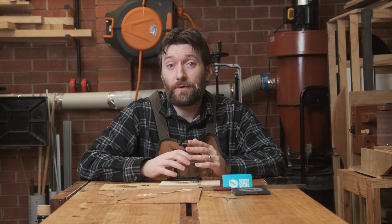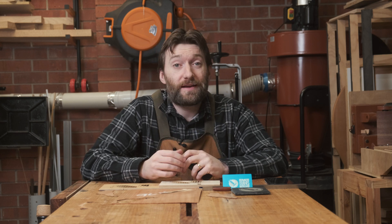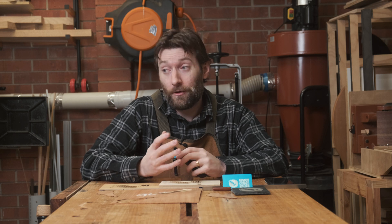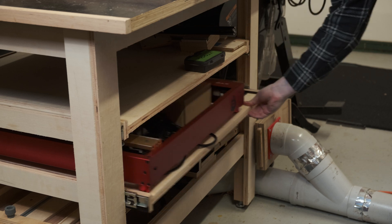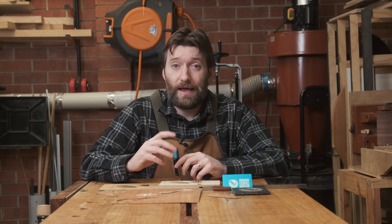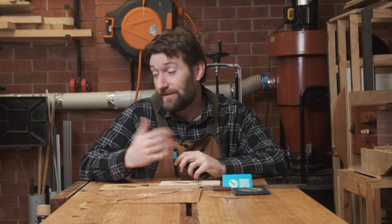Should you get a laser over a CNC router? That's a tricky question because while they are similar, they end up complementing each other because of what they both excel at. If you're more into 3D machining or cutting through thicker material more frequently, a CNC router is probably a better choice — but that comes with significantly more noise, a steeper learning curve with feed speeds and bit geometry, and finer detail is often lost. You certainly can't do marquetry with a CNC router — the veneer would just explode. They also tend to take up a lot more space. For me, this laser is about right: the footprint is small, I can even fit it in the drawers under my outfeed table, and it lets me add a level of personalisation that's otherwise pretty tricky to do by hand. The two major negatives are really just the enclosure — which can be sorted easily enough — and the overall price, which I don't think is unfair compared to the rest of the market, but it still isn't insignificant for the 20-watt model. Let me know if you're interested in seeing more content like laser marquetry.